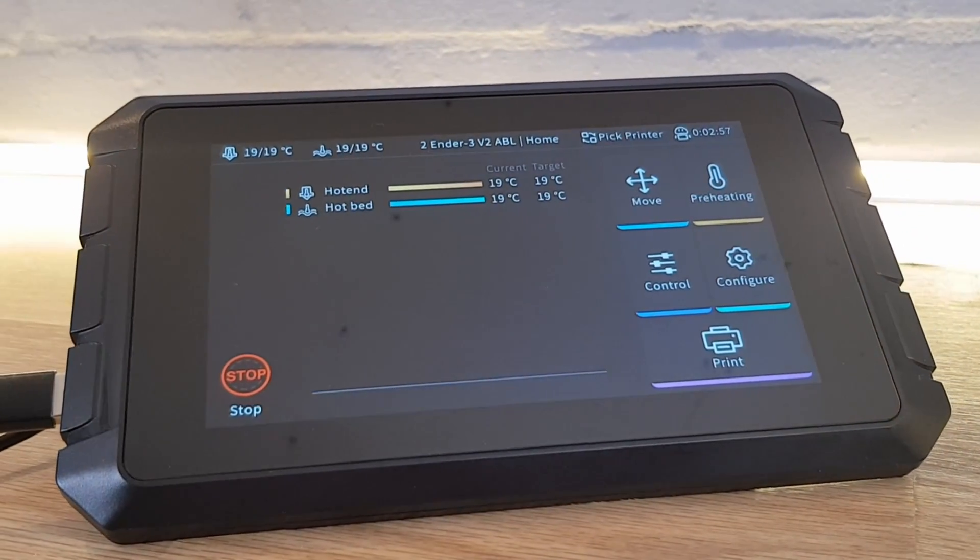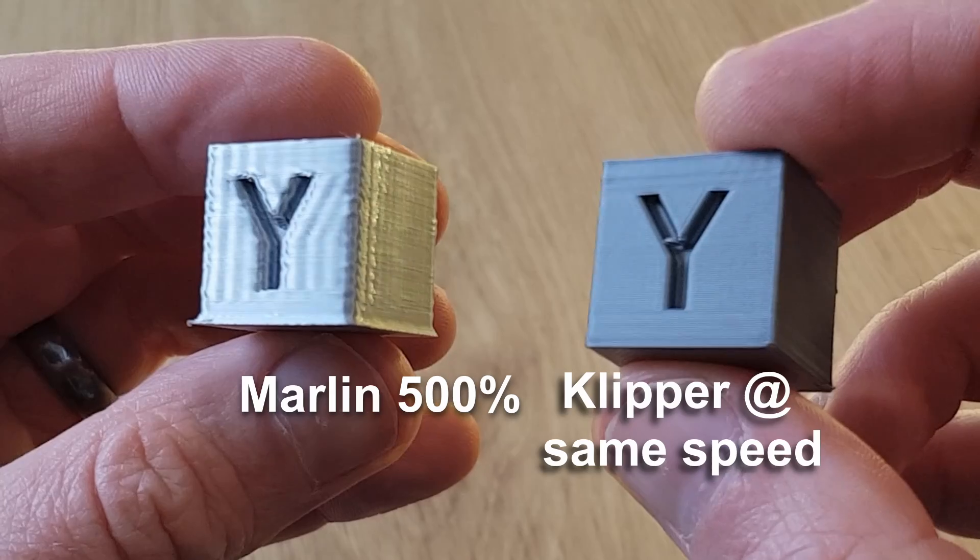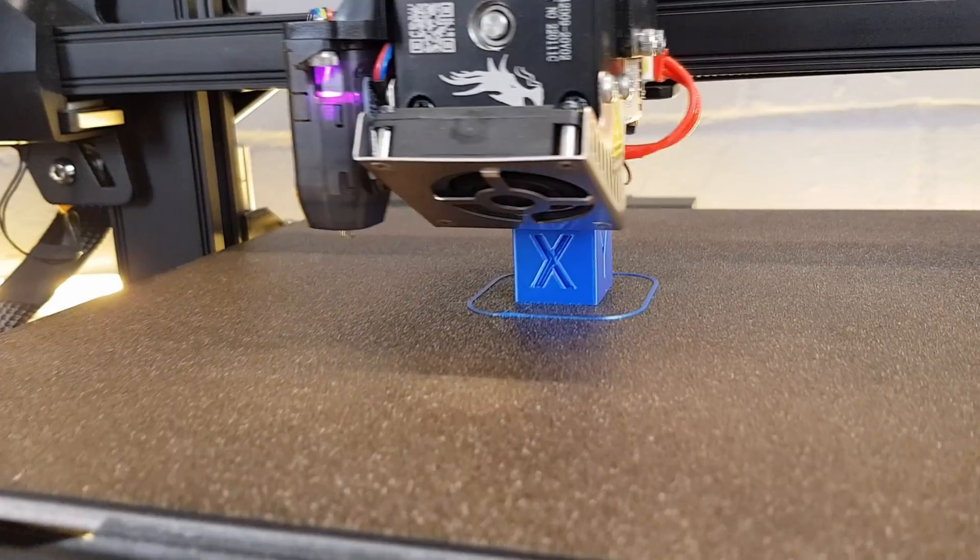What we want to be able to say instead is, 'Oh, no time at all — it'll knock that part out in about 20 minutes.' To capture people's imagination and become a must-have device in every home, what 3D printing needs to do is speed up. This is where Klipper steps in. With the extra processing power something like a Raspberry Pi or Sonic Pad can supply, Klipper is able to push your 3D printing speeds way higher without inducing all of the negative artifacts you'll get if you just try to crank the speed up on standard Marlin-based firmware. Once finely tuned, it can be quite common to reduce print times down to about a quarter of what they would have taken before on a stock machine.